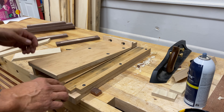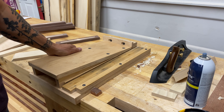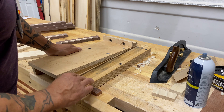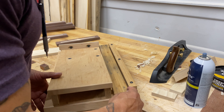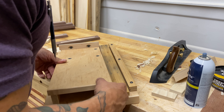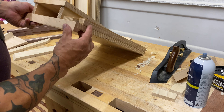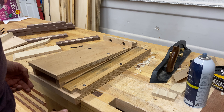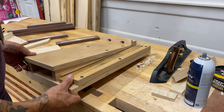Let's check out some more key features. This material looks like a plywood — like a Baltic birch with bamboo. I believe the bamboo is for its wear capabilities. There's a little cavity on each side so if you get sawdust or debris it will fall down in there and not hinder the cut. This piece is adjustable, but you have to make sure when you clamp it that your bench dog doesn't press the side and squeeze it — I learned that the hard way the first time; I had it up too high and the hand plane wouldn't slide.